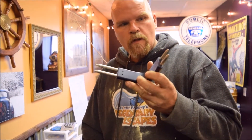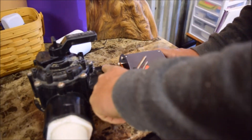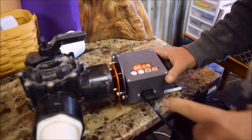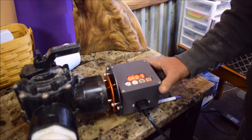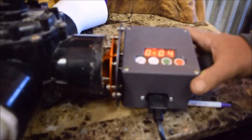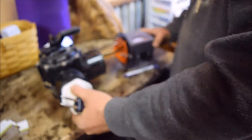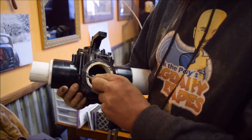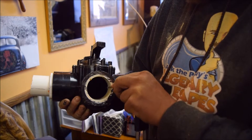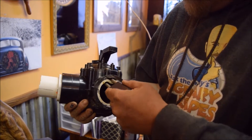This is the extraction tool used to pull the inner piece of pipe out. The fitting itself is just barely warm to the touch — it's heating just the inside, not the entire pipe. We're running down to the last 10 seconds; the unit turned off and is no longer glowing. When it goes down to zero it's ready — they recommend testing at the nine o'clock or three o'clock position to see if the pipe has separated, then work it with a little practice.